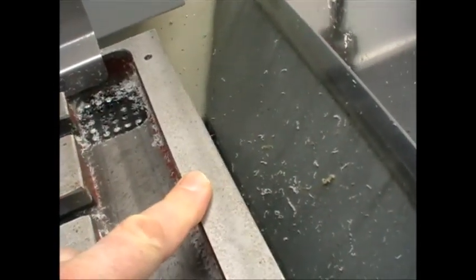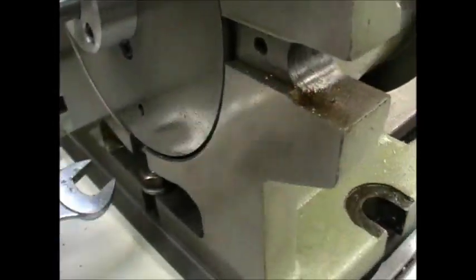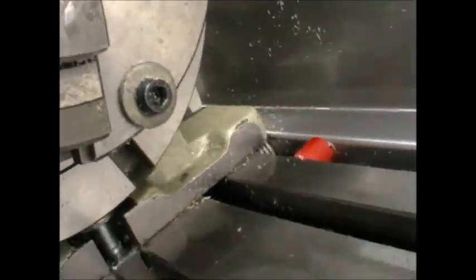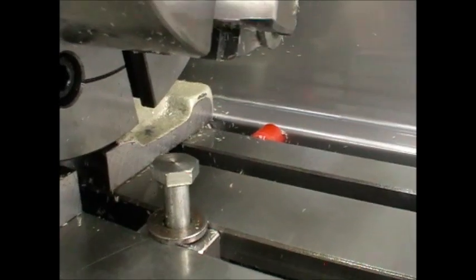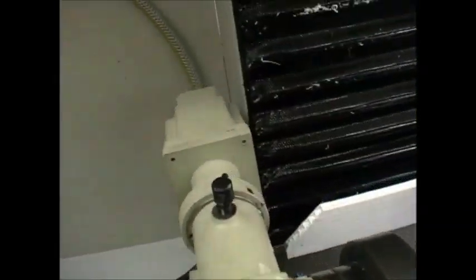To achieve that, I tapped a hole — from memory a 10mm thread — in the rib of cast iron here. I didn't want to put a really big thread in there and weaken it, so it's quite small — about a 3/8 thread in imperial. I cut some special nuts that are the same size across the flat as the standard nuts I use. The front uses a conventional-sized T-nut and bolt that just fits under there. I did need to machine just a few thou off the top of a bolt so it would slip in underneath, but it's a nice tidy way to hold it quickly at the extreme end of the table, and the stepper motor clears the column.